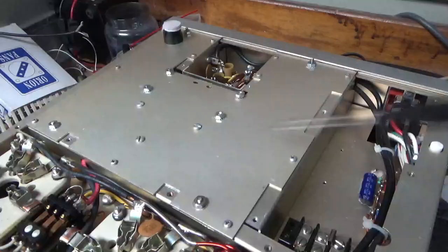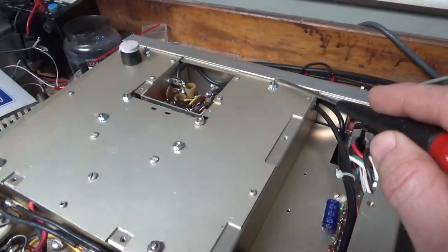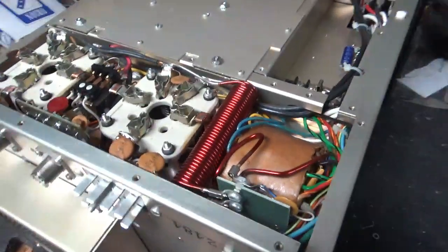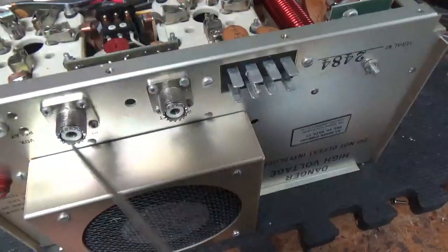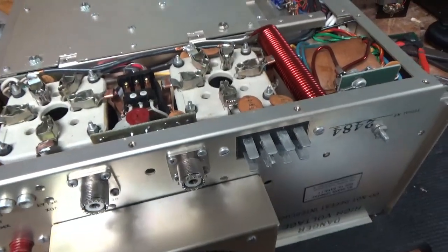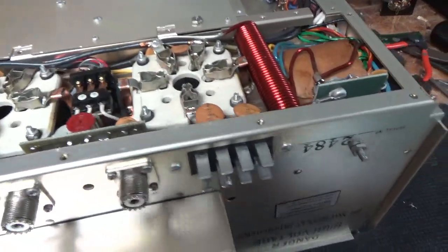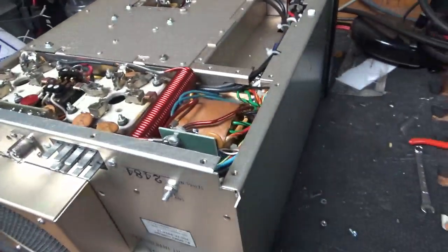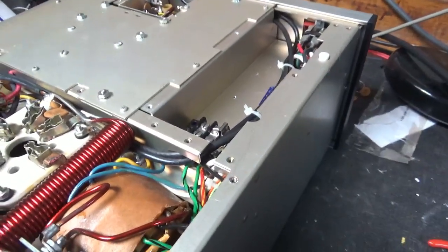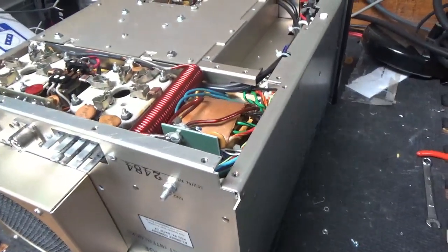These nuts were also loose. I snapped them off — I tried the double nut method but that didn't work, so I just carefully put another nut on there and bent it back and forth and snapped them. Those are set. The SO239s are good — I didn't have to change those. This amp is older than me and believe it or not they're good. The ones in the Ameritrons are just poor quality. I only change them if they need to be changed on amps like this — on the Ameritrons I always change them because they're usually bad or almost bad.